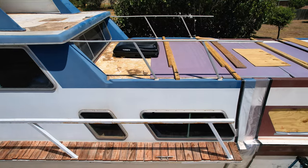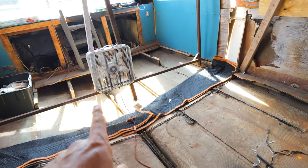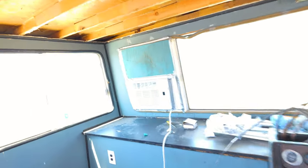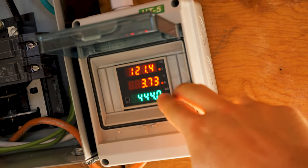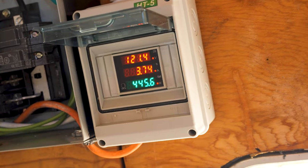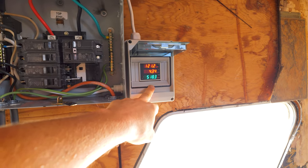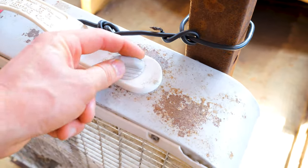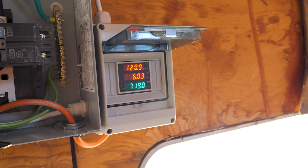We've got the small window air conditioner up front, the rooftop unit installed, the air filtration system, and two old box fans. Let's fire it all up. The front air conditioner is pulling just under 4 amps — about 440 watts — pretty low power. Kicked the air filter on high: up to 517 watts, 4.3 amps. Both box fans on: up to 6 amps, 720 watts.